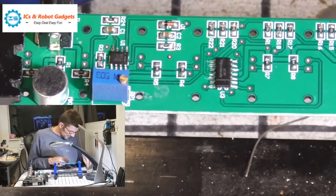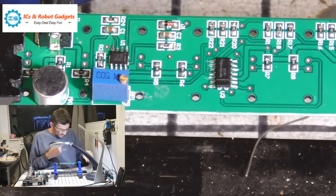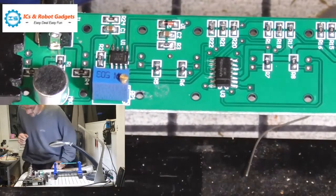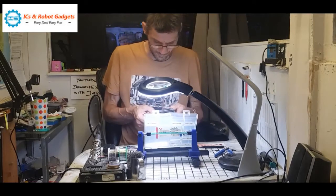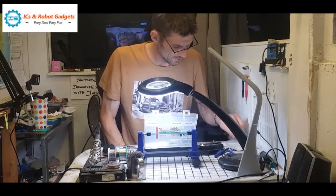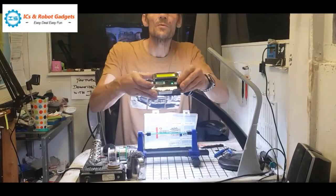We've got the 10 LEDs, now we have to decide where they're going to go, because they've given us a clear red, a solid red, four blue and three yellow. So I'm going to find an IC picture, see what they've done in the picture, and we'll go from there. Right, what I'm going to do is check the forward voltage on these LEDs, or a couple of them anyway, and then I'm going to swap around. That's 1.89 volts on the red, the blue. So we've got the LED tester as normal.